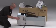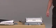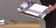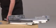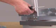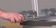To attach to the conveyor, I need to remove three screws. Now I need to put the leg on the conveyor unit. I'm going to flip it over, and on the side with the bar here I'm basically going to place the leg. I'm going to loosen this screw a little bit and it should drop into place. I don't want to take the screw out — I just want it to drop into place, and then we can tighten it.